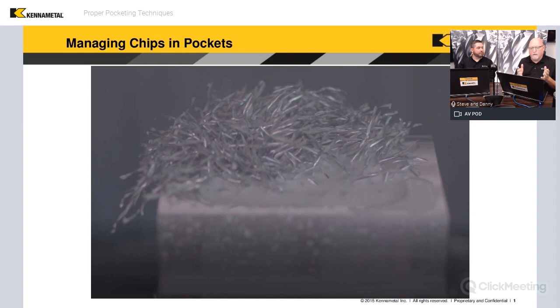The reason why they were recutting chips: they were on a horizontal machine, but the part was a banana-shaped type part. Instead of mounting the part as vertically as possible so chips fall away, they had it mounted in the worst possible scenario — they basically turned their horizontal machine into a vertical machine as far as controlling the chips. They had a good reason: they were trying to maximize production on a tombstone, but still it caused chip problems.